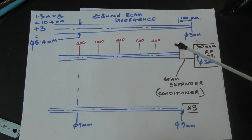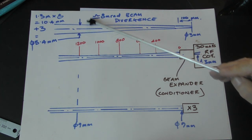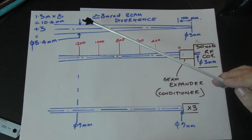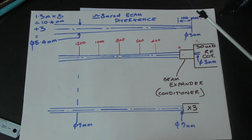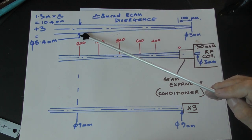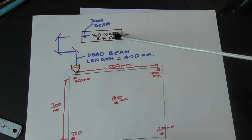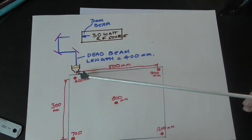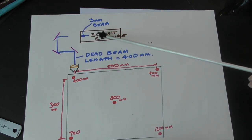The problem is already demonstrated with my white light example. When we had a big beam passing through a big lens it could do a huge amount of concentration of light down to a very small focal point. When we had a small beam, it was not really able to focus. From this alone we should understand that a big beam produces a much better focusing effect than a small beam. Here's my laser source firing at mirror one, mirror two, mirror three, and down to the lens - burning a spot at the back left corner, the closest I can ever get to this source.